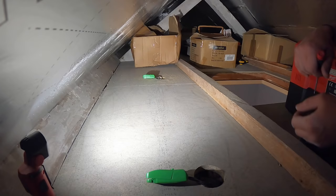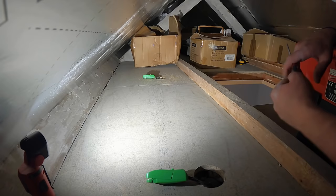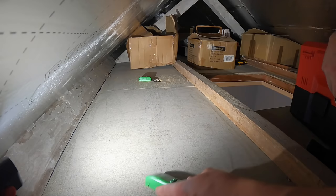What we're doing here is we've got the old pendant here, so we're gonna have to drill a hole here, bring the cable up through this floor, and then probably put a Wago box or similar. We've hoovered up. We're not gonna do any more because obviously I've got to drill another hole. And as I said, we'll do all our clipping along here to our lights and second fix. This is easier to second fix. Just saves all the crap falling back through the holes as well.